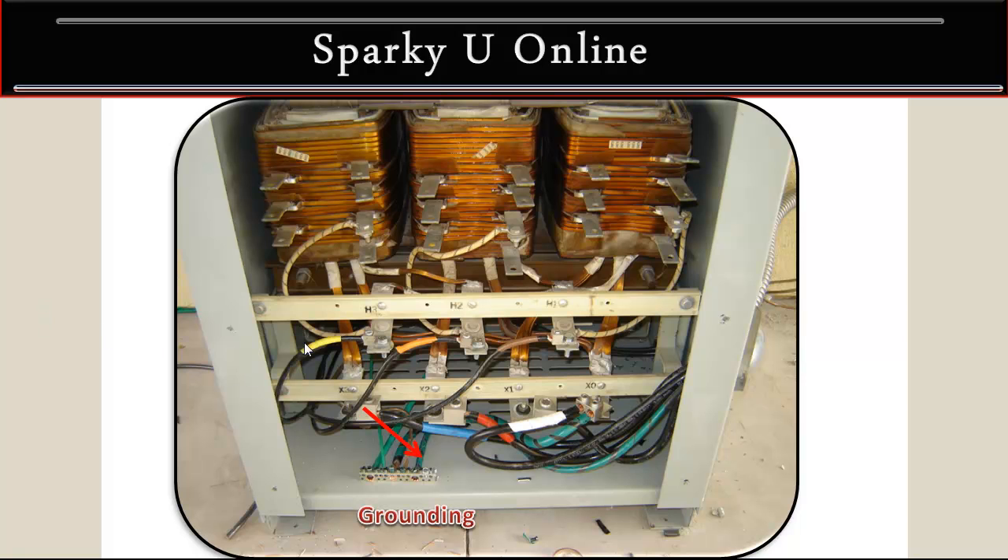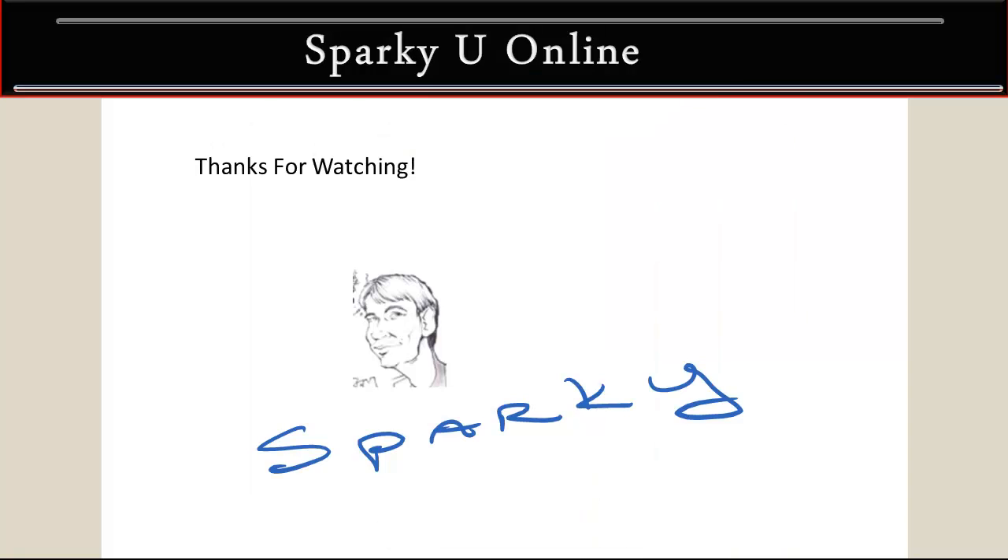The overall layout: you've got your high voltage up in here, your low voltage down here, your grounding down in through here, and your neutral bond jumper which goes down and around into here. Use grade 5 nuts or bolts on here as far as your connections are concerned. Use factory settings as far as the torques on this, and you should be pretty well set. Thanks for watching and have a great day.